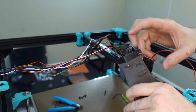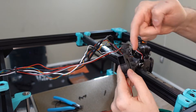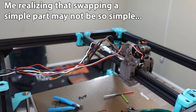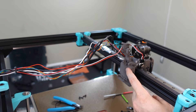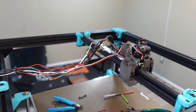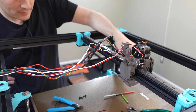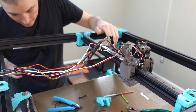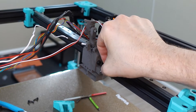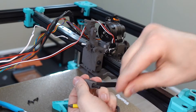Kind of a cool part, but I don't like the fan design. I've always liked these impeller fans better for part cooling - they suck in air through here and blow it out there. There's nothing to capture the nuts. The only way to do this is to put the captured nuts in this piece, which requires taking this piece off, which requires un-tensioning the belts. I hate captured nuts. Re-tensioning the belts isn't the worst thing though. This thing has a lock nut here and a hole for an M5 there - the bolt goes in from the other side and as you screw it in, it pulls this in, which is what tensions it.